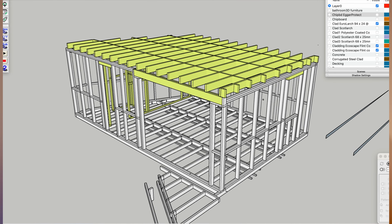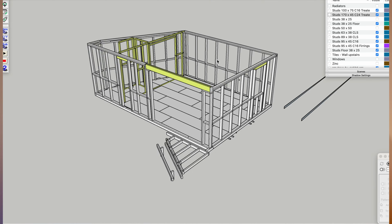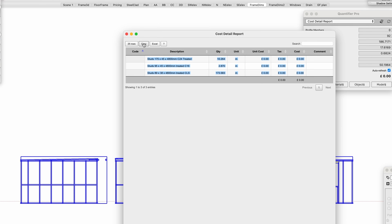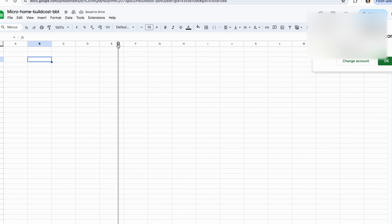I use SketchUp to plan everything out — I draw a simple 3D model with all timber studs defined, and use the different views to quickly generate a cutting schedule, transferring it to a spreadsheet. On site, I take a screenshot of the elevation drawing with dimensions and refer to it on my phone in the cold and windy Scottish springtime. I'll leave a tutorial video in the description on how to learn this easily.